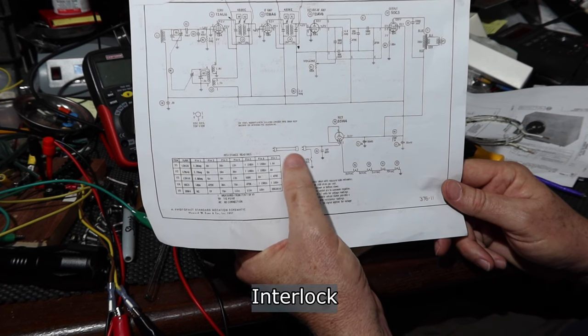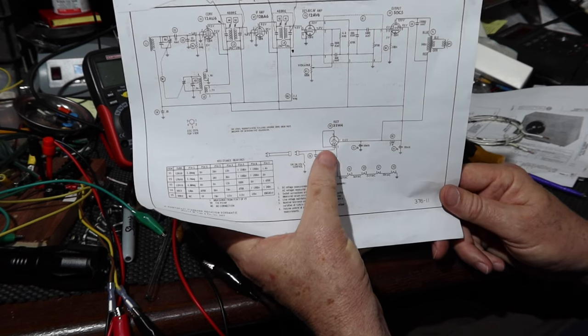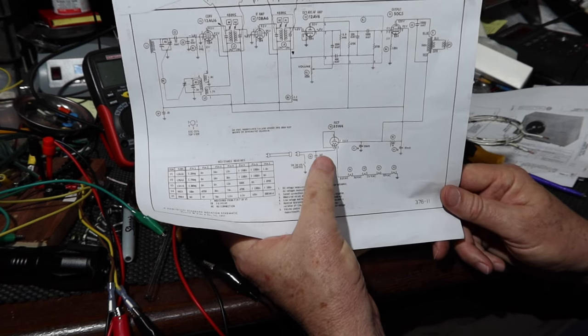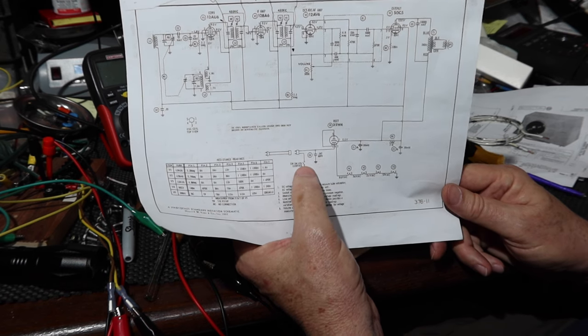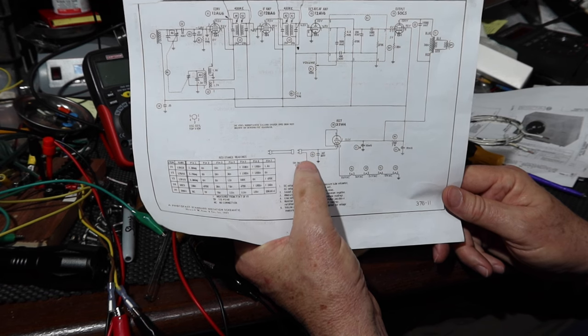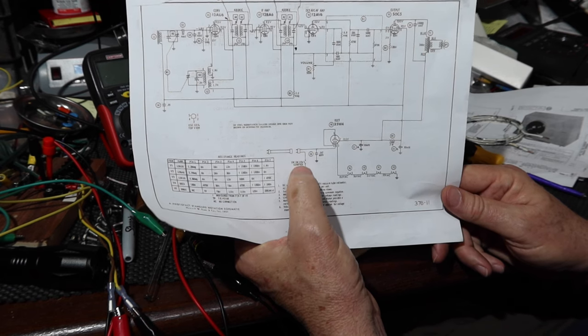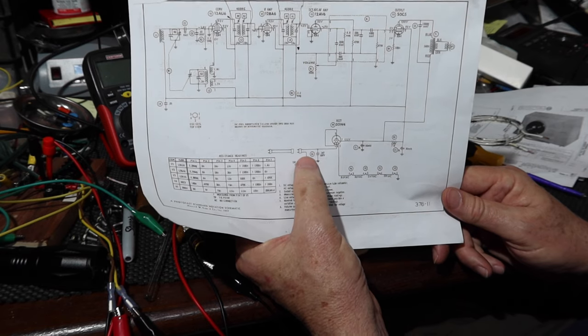And I'm going to leave the cord since it seems to be okay. And then in terms of who's getting the neutral and who's getting the hot, I think what I'll do is I'll put the fuse between the switch and the plug. So I'll put it on this leg here, so that if something goes wrong, it'll blow here before you get to the switch.